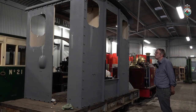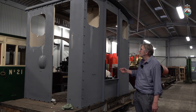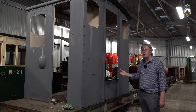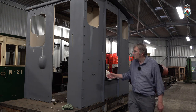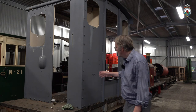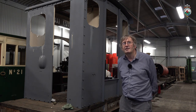Here's the cab for No. 87. It's been shot blasted to get rid of all the old paint and it's had some repair work. It's also had some slight modification because we've changed the brake arrangement on 87 — we've got the handbrake and the vacuum brake as on the later engines, and that means the back of the cab can be reworked because the handbrake is in a different position. We've added this bulge to the side of the cab which allows you to operate the handbrake handle inside. The whole thing's now been shot blasted, cleaned up, and painting has started — you can see the cream inside and obviously the outside will have some coats of nice shiny black to match the rest of the engine.